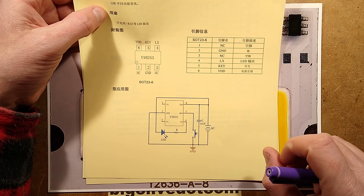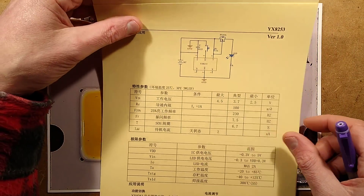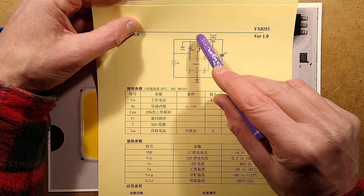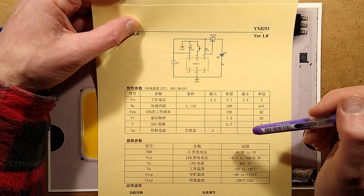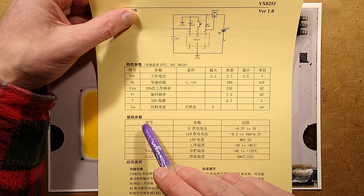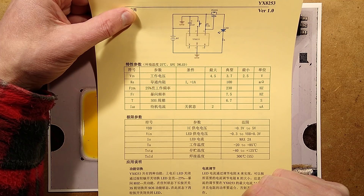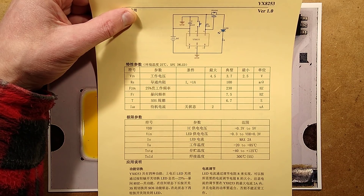The pads here don't make much sense for that capacitor placement. We have the button input, the LED and resistor. The datasheet also shows a schematic driving a bigger load via a P-channel MOSFET — the output pulls to ground, which switches the P-channel MOSFET on via a pull-up resistor, driving much bigger loads. The chip is rated up to 5 volts, with a quiescent standby current of 2 microamps at 4.5 volts, which is tiny. I'll check that right now.